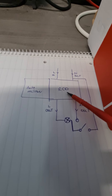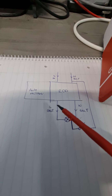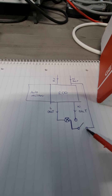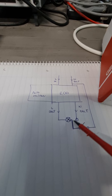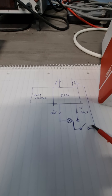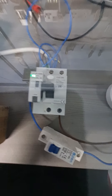What we have done in this particular video is connect the RCD using the following circuit. We have our RCD and our auto recloser. In order to create a permanent earth leakage fault, we have connected an LED bulb with one terminal connected to L out, then a switch — in this case a single pole MCB — and we are connecting the neutral output to the neutral input of the RCD. I am doing this to create a leakage fault without tripping the main RCD in my workshop. There is my simple arrangement: I have the RCD, the single pole MCB, and there is my light bulb.